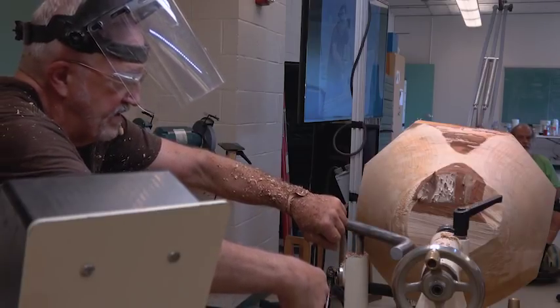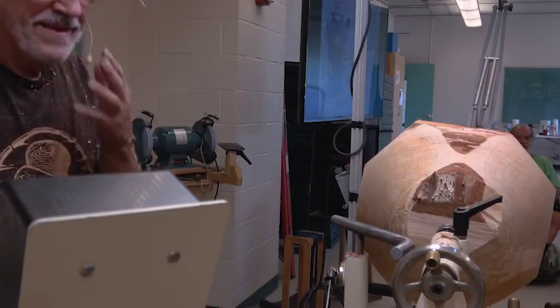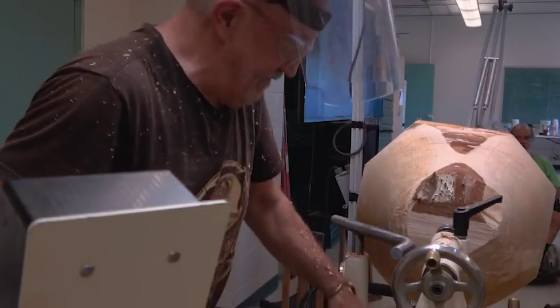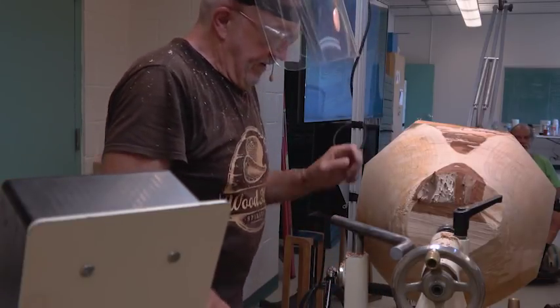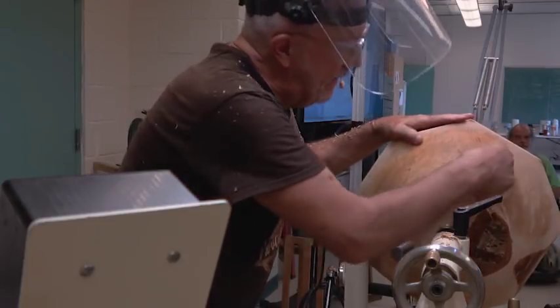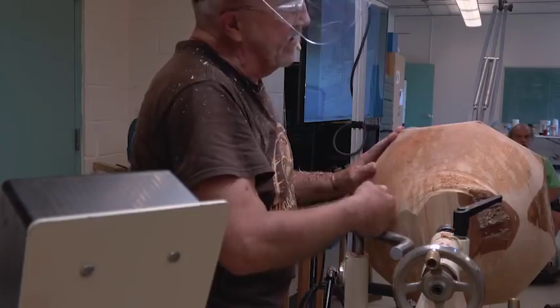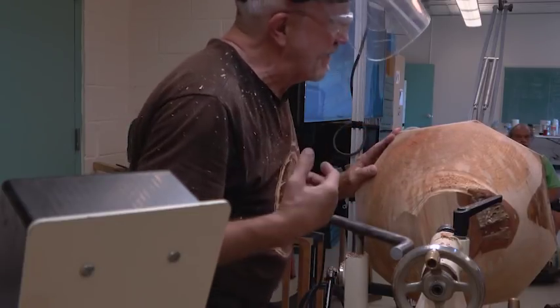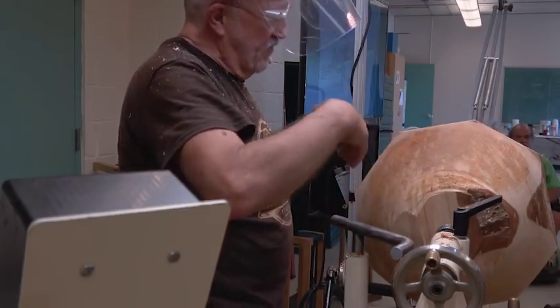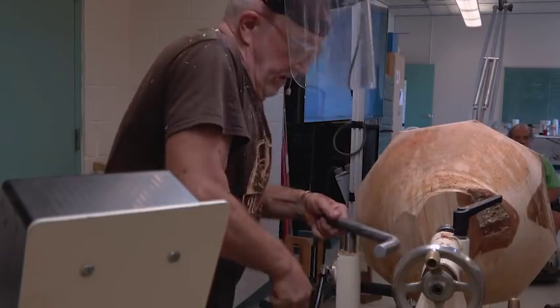Okay, I'm going to let go. Don't change anything. And I walk away. Now you're rubbing the bevel. And that's all it takes. One shot like that, and they got it. Just got to push them a little bit. But you see the difference in the cut. I'm shearing the wood. I'm cutting the wood free before I'm asking it to go away. The other tool doesn't do that. It just chunks it away, but it takes the work out of the roughing down to round for you.